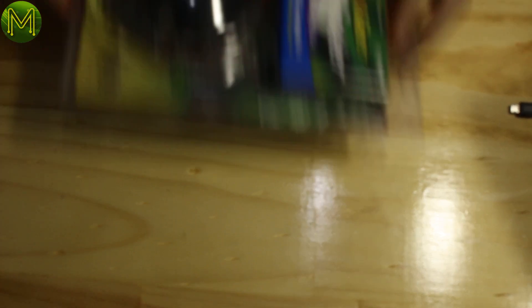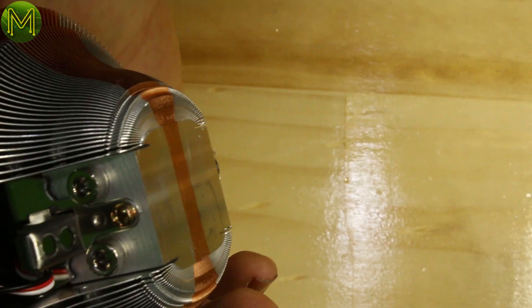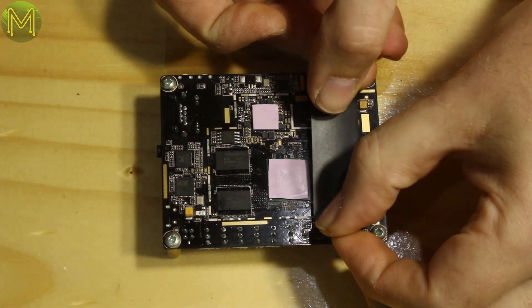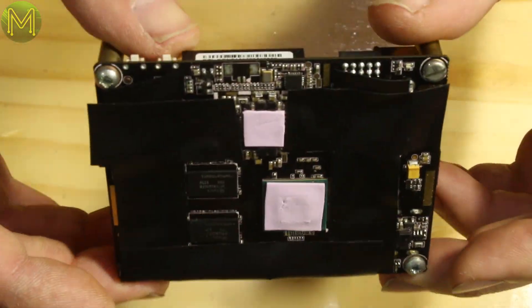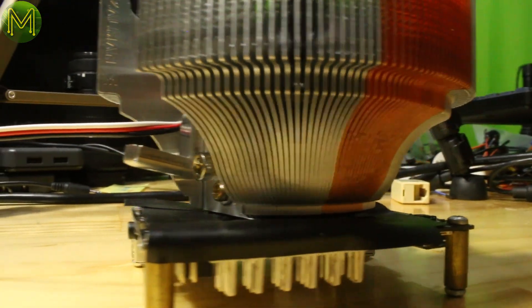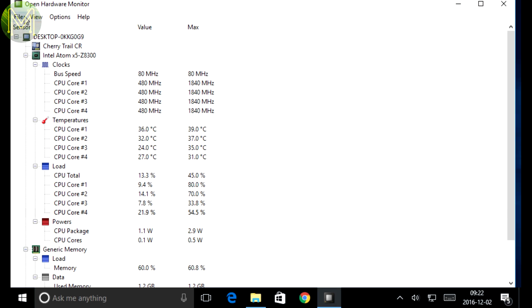So what can I do about this? Well, I can go completely overboard and use a desktop CPU heatsink and fan unit. This has a chunky bit of copper that will unquestionably draw any heat away from the LattePanda CPU. Even though this is a 12V fan, it'll still work under 5V, and it only drew 100mA by itself. Adding electrical tape is kind of important, since I'll be putting a large bit of conductive metal in a place it normally wouldn't be. And carefully lined up the thick bit of copper to rest on both chips. If you do this yourself, make sure it's placed firmly — any air gaps can lead to overheating. The weight of the heatsink keeps it firmly in place, just for testing. Next, connect up the LattePanda and power on.